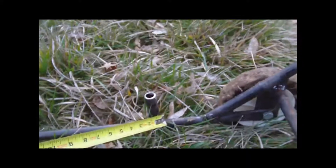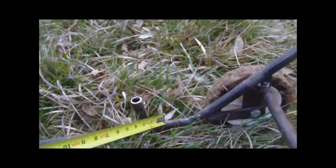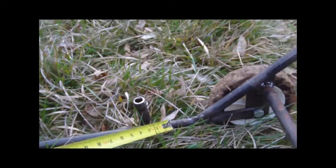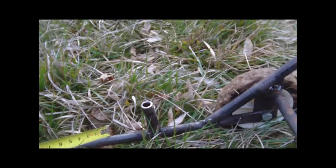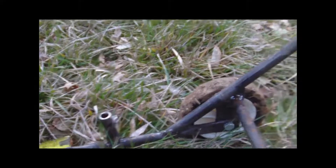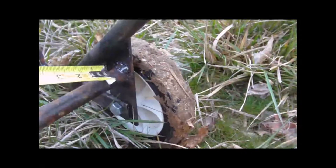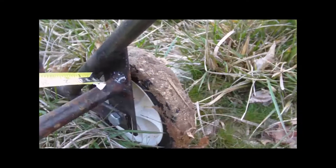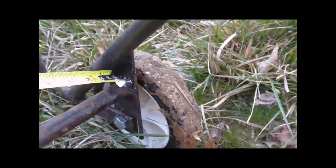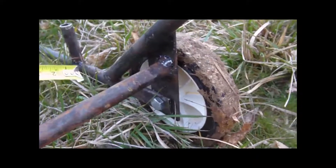About 4 inches back from the joint — or the crotch where this bar and the arms meet — is a piece of pipe that's about 3 to 4 inches tall, welded on to act as a backstop. With respect to the axle, I took a piece of pipe and welded it up about 3 inches or so, so that the axle is above the ground level — about 6 inches or so — so it doesn't catch on hummocks and what have you. You'll see a profile of that in a minute.